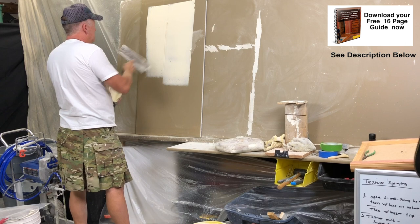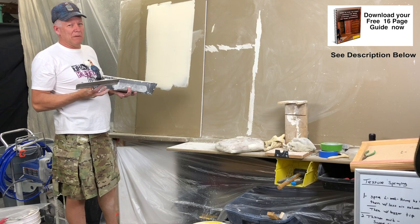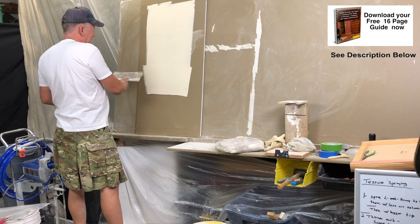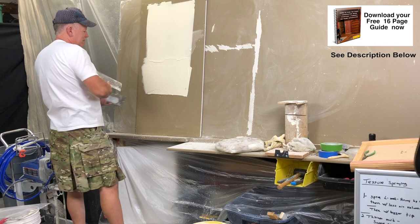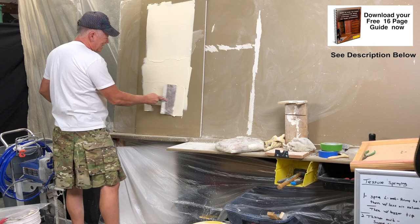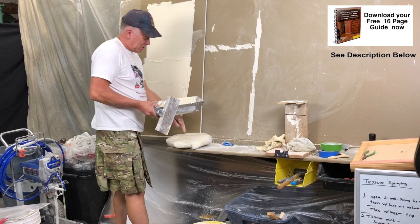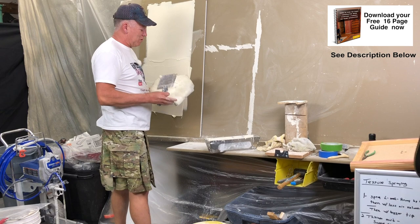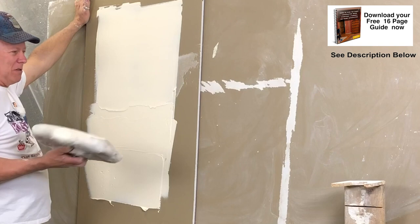We're going to spread some mud on the wall or ceiling — you could roll this on, that's how I'd probably do it for a lot of area. The look you get will vary depending on the thickness you put it on. Let's do a thicker section down here and a thinner one up top — medium thin up there, medium thick down here. You'll usually want to load your stomping pad up and get it started with some mud. If you've seen my stomp brush texture, it's a similar concept but gives a different look.